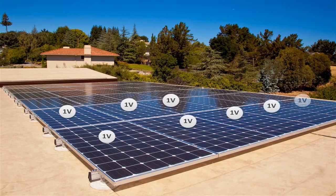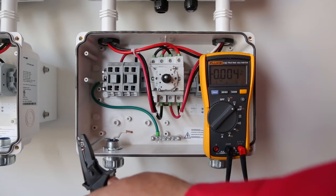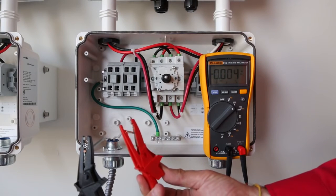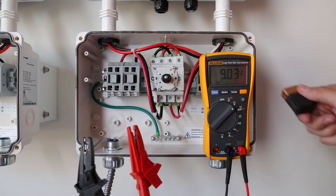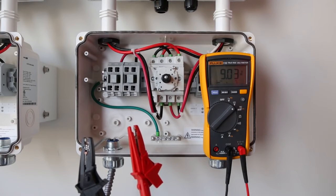Optimizers output one volt safe voltage prior to the inverter — I'm actually commanding them to export power. Since voltages add in series strings, we can measure the number of modules in each string. In this example we have nine modules, and as you can see our DC volt meter is displaying nine volts.